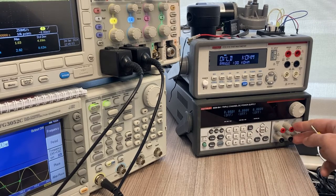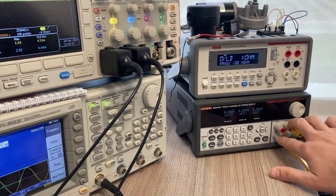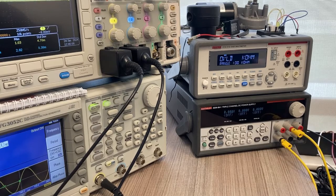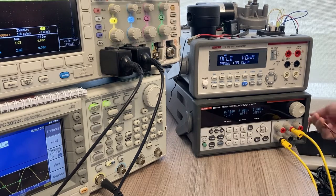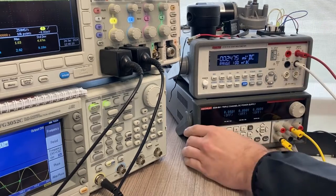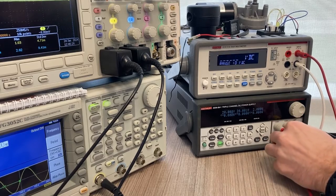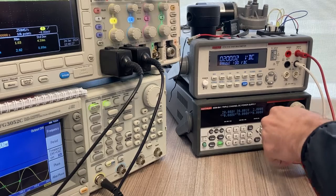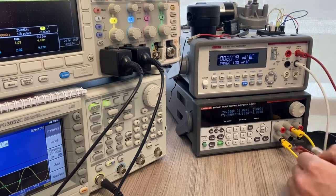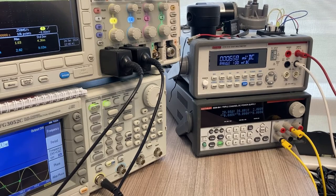In order to get negative 20 volts on channel 2, I'm going to force this to be common ground for both channels. From this point to this point we get 20 volts. I measure the voltage on channel 1 and get 20 volts on the multimeter; from this other point I get negative 20. The connections on the yellow wire are going to be my common ground.